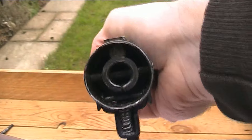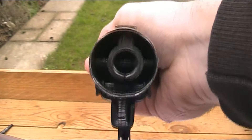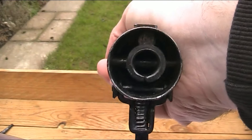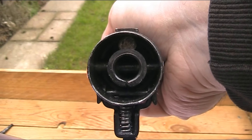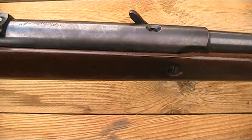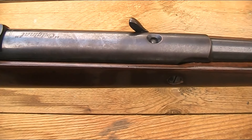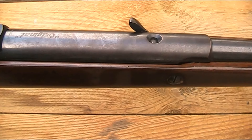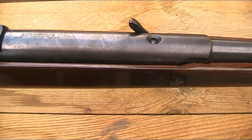There you can see the rifle safely back together. I forgot to mention that when I stripped it down, I had the additional hassle that when I changed the piston seal, I couldn't unscrew the old screw holding the seal assembly in place. That screw then broke off, so I actually had to drill it out and recut the thread for the new screw in the end of the piston.